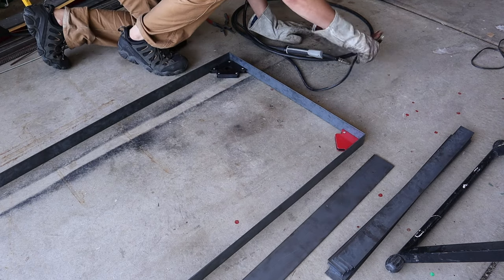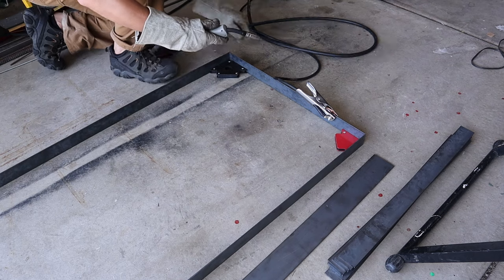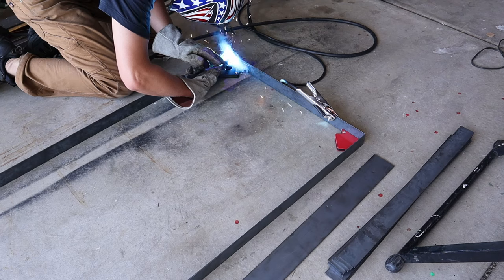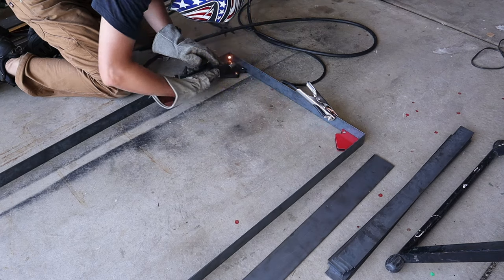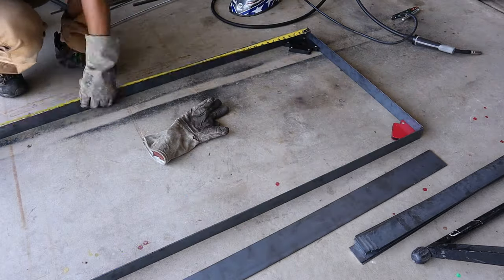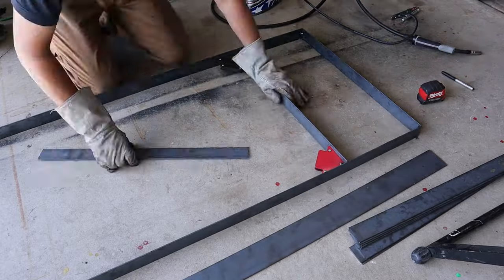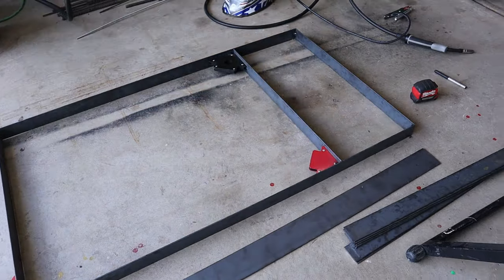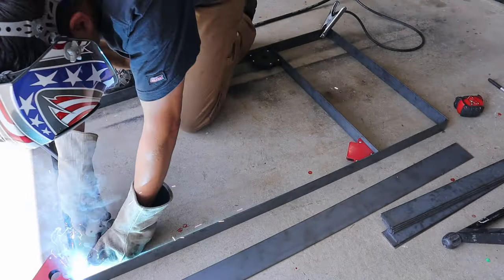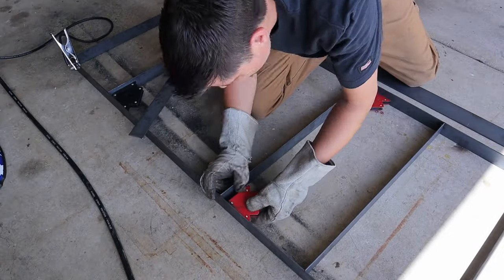I would suggest keeping an open mind. For example, I was going to go with a 1/4-inch tabletop, and they had some 3/16ths on surplus, so I went with that. I was concerned I'd have to add more stiffeners, and I started out with 12-inch spacing — I guessed right, because this is just perfect. I ended up picking up three 20-foot lengths. Steel typically comes in 20-foot lengths. If you don't have a way to move that, just tell them to cut it in half or in the sections you want. They'll charge about a buck per cut — well worth it.